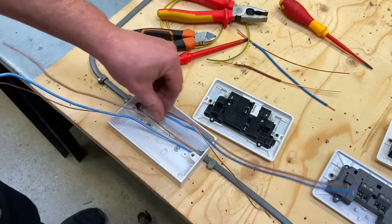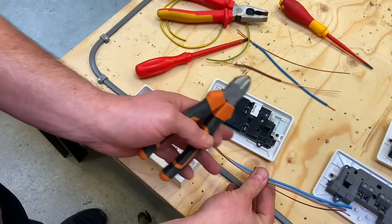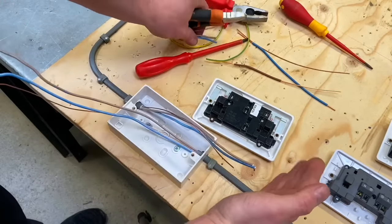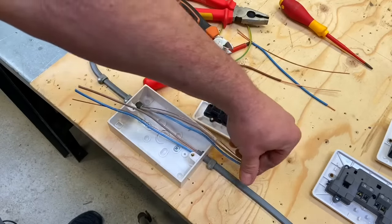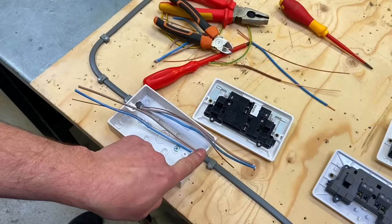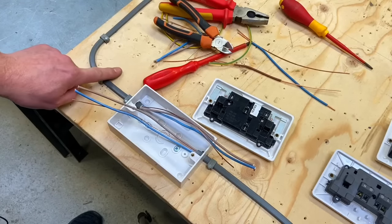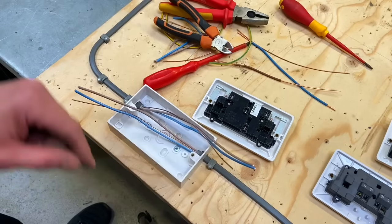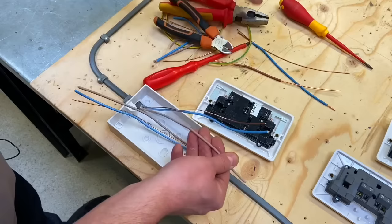Let's dress or cut our cables to the right length. If they're coming in from the sides, I like them to go past the box — for my students, between 50 and 70 millimetres. So we've gone 50 to 70 mil past in the direction they came from. The same on the other side: 50 to 70 mil. So our cables are longer than the box in the opposite direction to the one they came in.